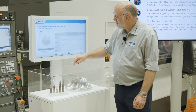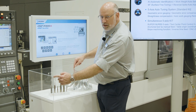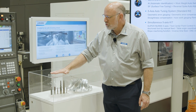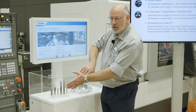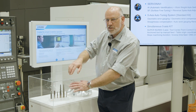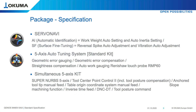For example, on one plane I have my zero offset at the top, and then on the next plane my zero offset is here and all dimensions are shown from this reference point. I can shift my zero offset to a new position, then tell the machine via the slope machining function to incline this surface — also rotating it and inclining around the third axis — and then program directly in this projection, same as all dimensions are shown on the drawing. That makes life very easy for the operators.